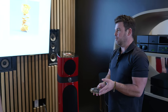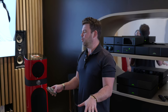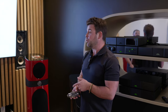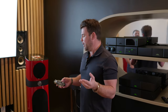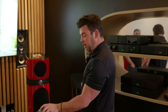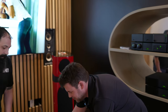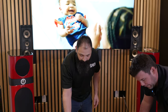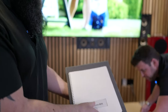For instance, in a Reference 750 — the biggest amplifier we make — for a pair of those, that's 16 to 32 tubes. We have to go through a field of 300 tubes to get the 32 that you want. So when you have a problem with a tube, you call me, give me the number off that tube, I go right to that batch and pull a tube from it — so they are all perfectly matched. You don't have to worry about your amp sounding different over time whenever you swap out tubes.